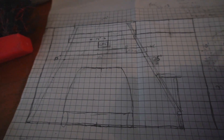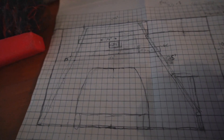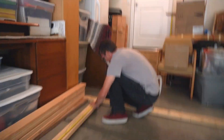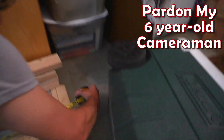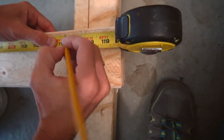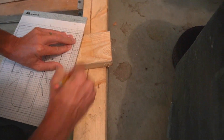Looking at our plans, I've also done some math on the 15-degree wall for the length of the board I need. I know that I need 9 feet 8 inches. With our 15-degree angles, it's going to end up being 9 feet 8 inches from this point, and also 9 feet 8 inches from this point on the bottom. So we're going to add 9 feet 8 inches plus 15 sixteenths. Then we'll cut the one board and that will be our template, and we'll match that up on the remaining four boards.